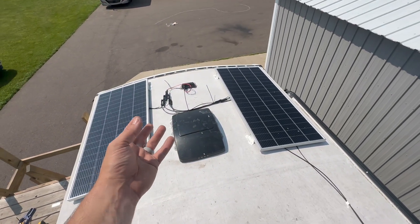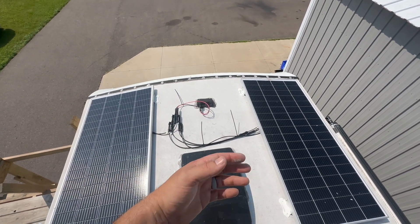The other thing to mention — when I say we're going to be about 20 amps, you might think you don't want only 20 amps into your battery. Don't stress about that. On the solar side, you want less amps — it's all about your power. If you're ever confused, look at your shore power cord: you're typically not pulling more than 30 to 50 amps and you can run everything. It's all about voltage. Volts times amps gives you watts, and watts is what we're after. The charge controller converts the higher voltage, lower amp power into lower voltage, higher amp power for your batteries. Let the charger do its job — give it as much voltage as it will accept.